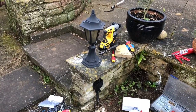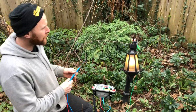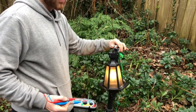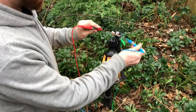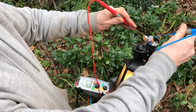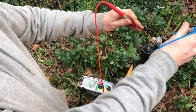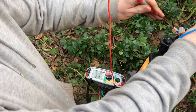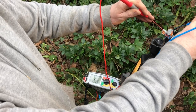Here we are on the last light of the circuit and now I'm just going to confirm the Zs to ensure everything is okay. I've got this crocodile clip on the back of the earth connection. I'll turn the tester on, probe on to both line and neutral — it takes about eight to ten seconds, it's the three-lead low test that we're doing. The tester is reading 2.15 ohms. We've got about 5.8 ohms maximum on a six amp breaker, so that's absolutely okay.